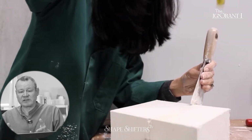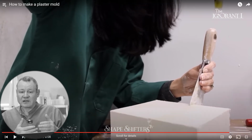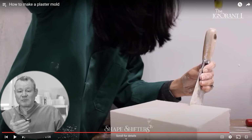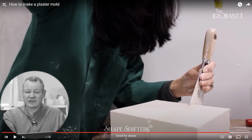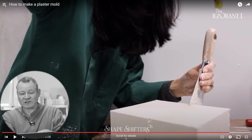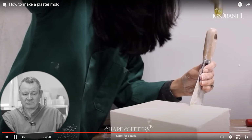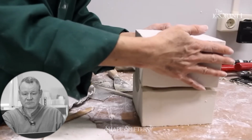Now, if she doesn't know where her keys are, okay. Two things. She can cut her keys, and also she has like a jewelry hammer almost. Mold making mallets, you want them because they have the weight, and they carry it for it. A dead blow hammer is the best, which is a rubber mallet with sand in it. But you can cut your mold keys like this. I used to do this all the time. It's a sensible technique, but not if it's not controlled. Her hammer's bad. You can try by opening it, hammering it gently in the middle of the mold.